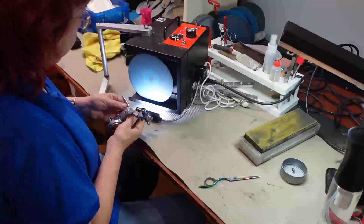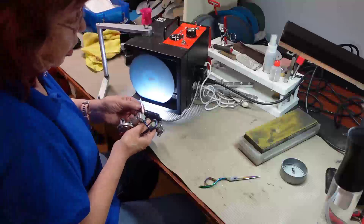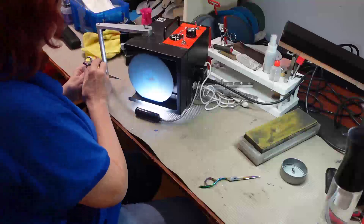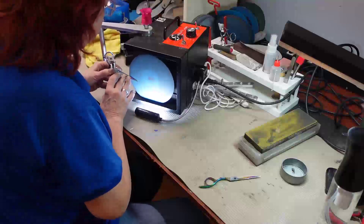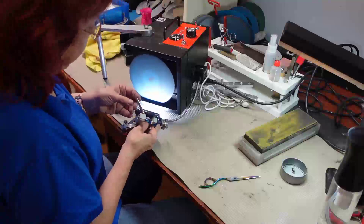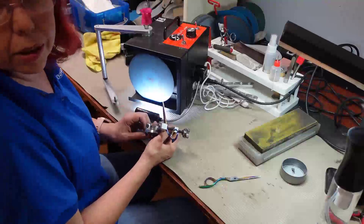I don't always tighten down the screw. Someone was concerned about the little bit of wobble in the clamp, but I'm always pressing down so there's no wobble when I'm actually approaching the plate. The machine is going at 80 percent speed — and I've got a burr that quick. Man, he really changed that angle over what I did; he must have done a really sharp angle. I don't want to go higher than 35, so I might have to do a slight rock just to blend in all his angles to my angle.